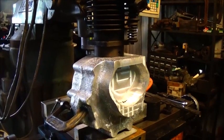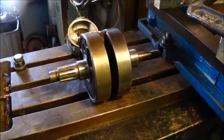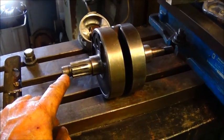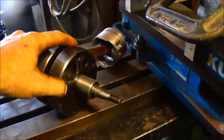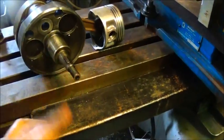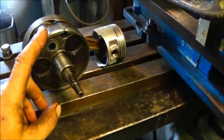This one here — we're using another Yamaha 250 crankshaft, right here. This crankshaft is a little different; it's a 1986 model instead of a 2001, so we're going with a four millimeter shorter stroke. I bought this cheap — the bearing's good on the big end of the crank, no problem there, so I don't need to take it apart. Somebody had hammered on the end and messed the threads up, but not a problem, we can do whatever — we're probably just going to break it anyway.